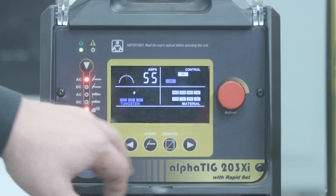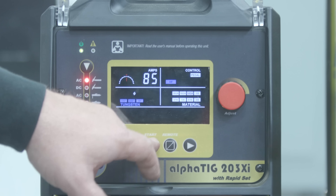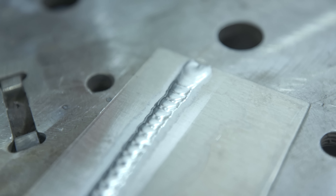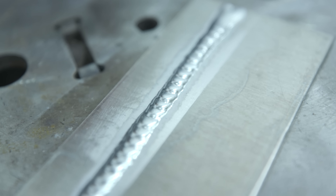We're going to try some aluminum — still running the 3/32 tungsten, got some 14-gauge material. I'm a big fan of pedal and high frequency; it tells us about 85 amps. Initial thoughts on the AC: it sounded a little funky, but overall it performed really well. No issues — good arc initiation, good arc stability throughout the puddle. The sound threw me off a little, just a different tone than I'm used to hearing, but I was able to weld with it no problem. A lot of entry-level machines have a hard time with arc stability — very unstable and erratic — but this one stayed right on point.